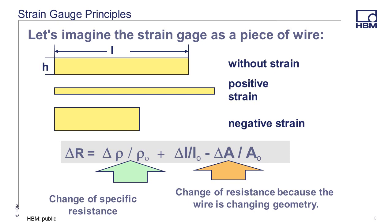This change in resistance is really very small, so it is difficult to measure that change using just an ohmmeter. An amplifier circuit using the Wheatstone bridge and a high gain is used to convert this change into a change in voltage, which is then converted into a strain value through a normalization process.